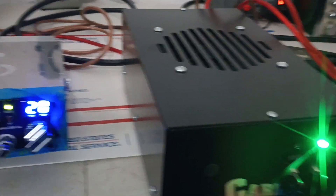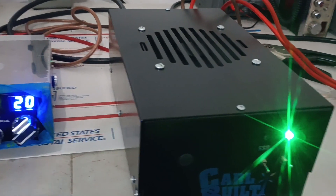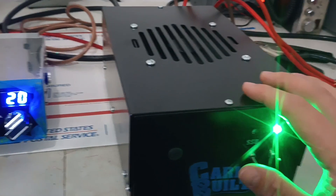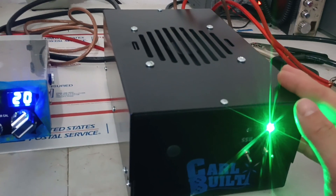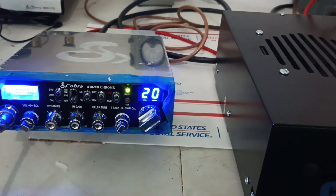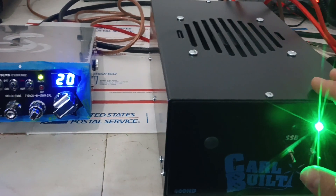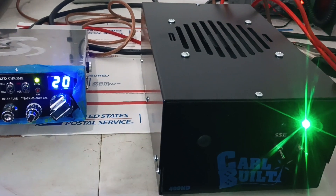About 380 average. So you may ask yourself — well, heck, you just did a video on a Fatboy 4-pill C box yesterday and it didn't show that kind of average power. That's because the C transistors take so much more drive. We're almost at max drive on this — about 75, 80% of the way. On that 2879 C amp, we were only driving it with about half the recommended drive. So that's why, if you're running radios like this — Stryker 955, Stryker 655 — the standard 2879s may be your better bet to get the most power out.